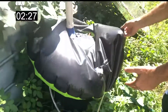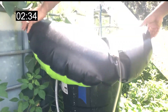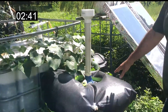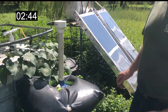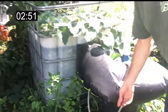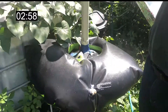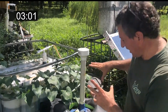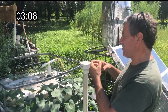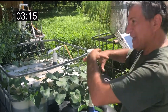We've probably used about half the gas so far, but we still have gas. You can see here it is being used up, but not that quickly. It's just coming out through a clear plastic hose. How long will it take to fill it up again? If the temperature stays like this, it'll take one day. An ideal temperature with one fortieth the volume of a mixed food source that has lipids, carbohydrates, and proteins — a balanced diet with the right carbon to nitrogen ratio — should produce its own volume in gas per day.